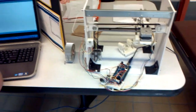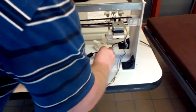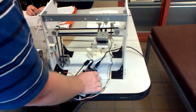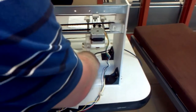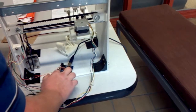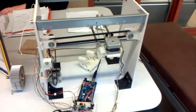To start, I'm going to turn on my serial monitor — this shows everything coming out of this port. I'm going to hit the reset button. Because I don't have my limit switches set up, I have to manually set the location. Give it a minute — it says 'start output' and it should start running and output information. There we go. You have to set the limits first.